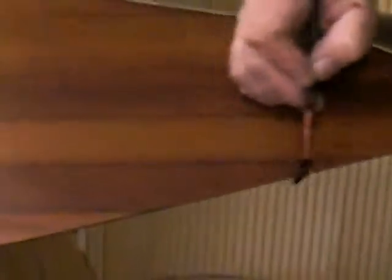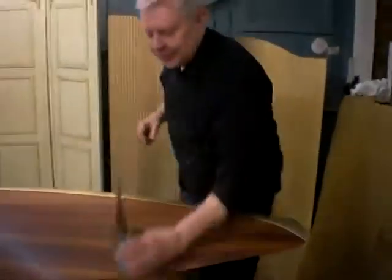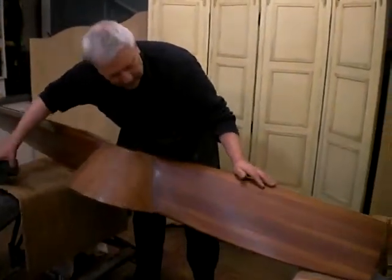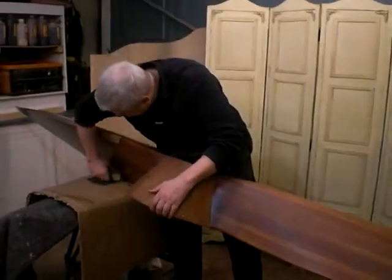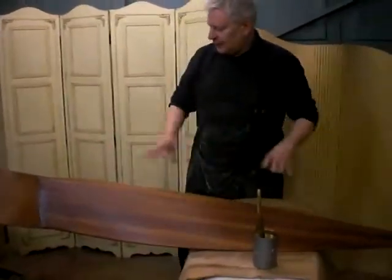The purpose isn't to make it look new, but I'll try to camouflage some of them up. Now we're going to use cellulose. What you've got to remember about cellulose is it tends to dry very quickly, so you've got to be really quick and keep the line going.